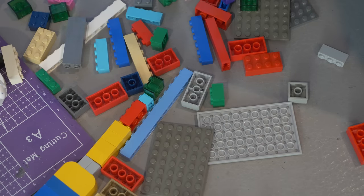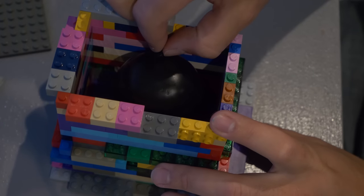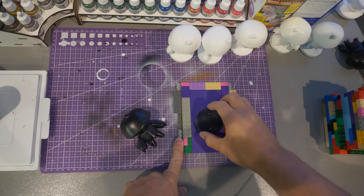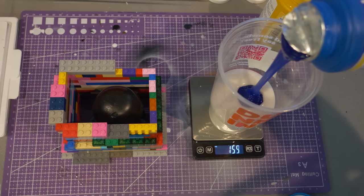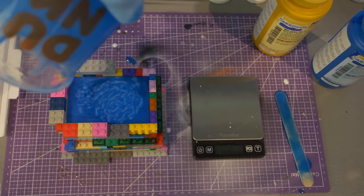The two-part mold that I made was good, but in order to start sending these to people, I wanted to improve some things like vents for the tiny fingers. This time, I'm going to use Lego — which would have been really on theme last time. That way, I'm going to make a single part mold that I split down the middle. I didn't want the top of my mold to be covered in Lego studs once it was flipped over, but wasn't sure how to make that work until I remembered that the purple plates from my unbuilt Wiggler's Poison Swamp would be perfect. Using a soldering iron and some beeswax, I soft welded a newly resurfaced Labco and some vents to the plate, and built a Lego wall up to the top for my silicone mold. It's very important that I tell you not to drink the blue raspberry, no matter how good it looks. The mold will be exactly the dimension of these Lego bricks, so I can reuse them later to reinforce the mold.